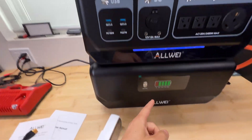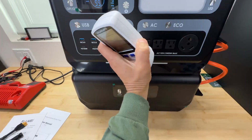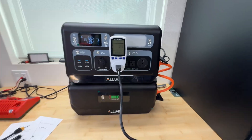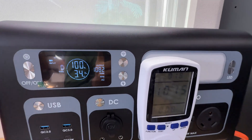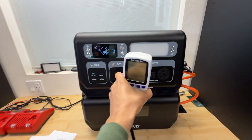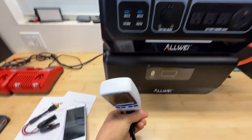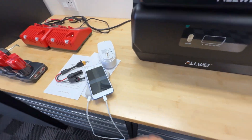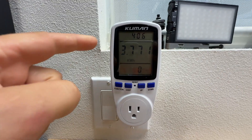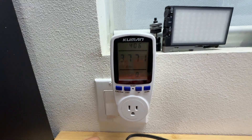With the station and battery fully charged I did a capacity test. The station shut down showing 5%, and we could not activate AC power anymore. We got 3,771 watt hours and the test took four hours.